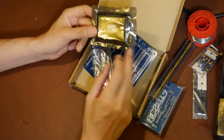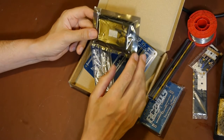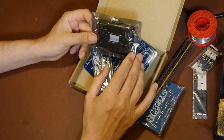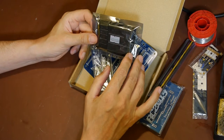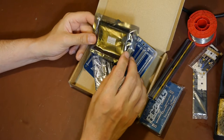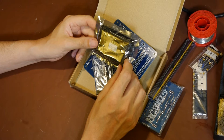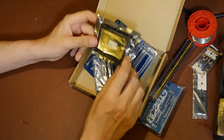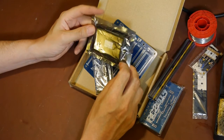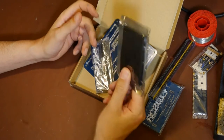For those who don't know the difference - this is a Z80 microprocessor, and it's different from a microcontroller. If you just get a Z80 chip and plonk it on a board it won't do very much. It needs a lot of external peripherals: a power supply, some RAM, some ROM, and address decoding for the RAM and ROM.